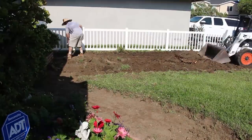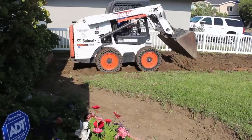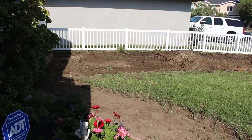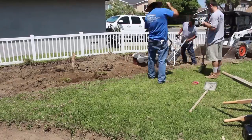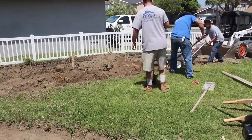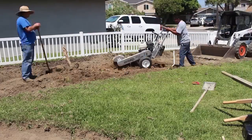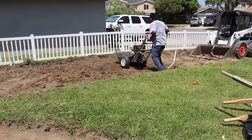I'm going to remove the dirt and grass. Since he's got a pretty large motorhome, I'm going five to six inches deep for the thickness of the concrete, and I'm going with half-inch rebar on 18-inch centers for this one.